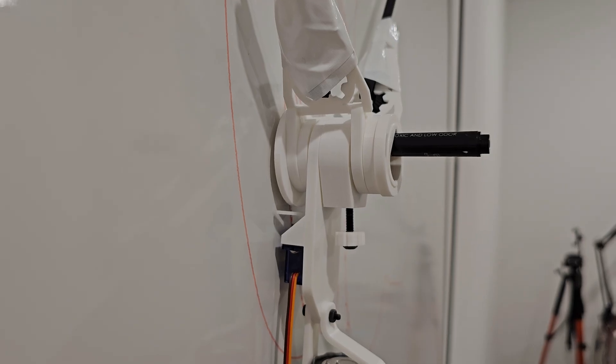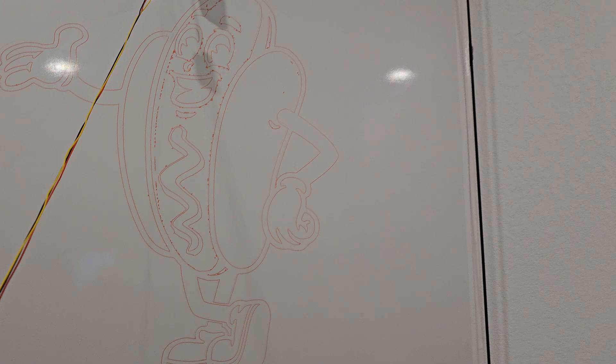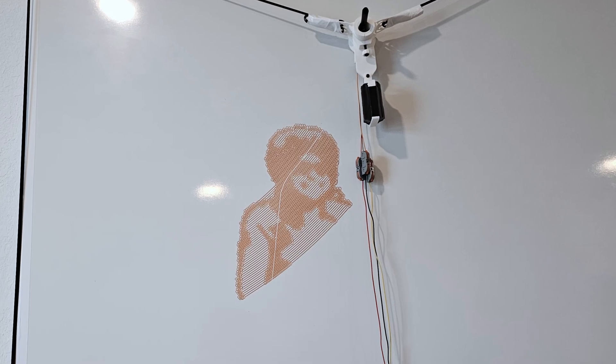The first thing I had to do of course was write down all my current subscribers. I promised my brother that the first giant thing I would draw was a wiener, so I got to work on that. I used Inkscape to bring in an image, turn that image into a set of paths, and then passed that to the polar graph machine. I'm super happy to see it working. Mr. Wiener is complete. I've made a bunch of other drawings since then but I've also been running into some issues. I tried to draw a piece I call 'nice lady on bike' but the servo halfway through apparently decided it was done and lifted up the gondola even though there were no instructions sent to it.